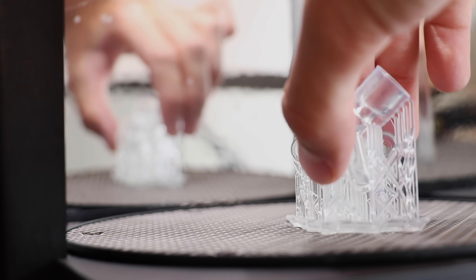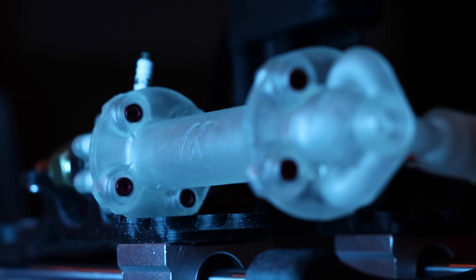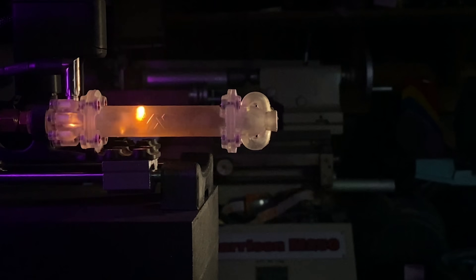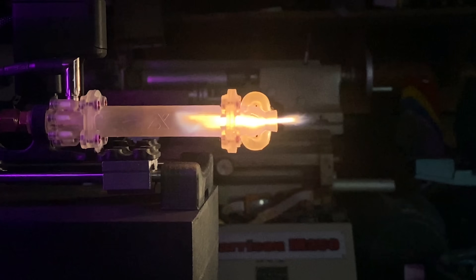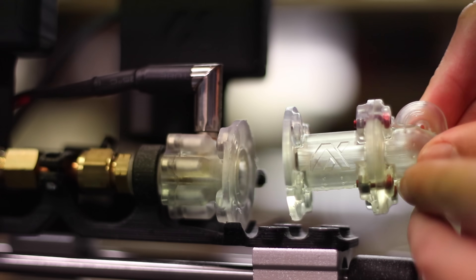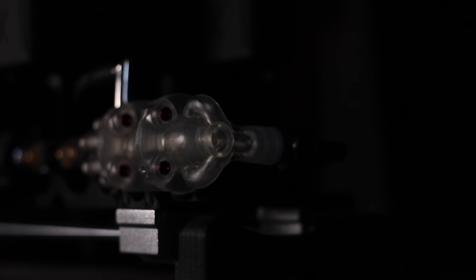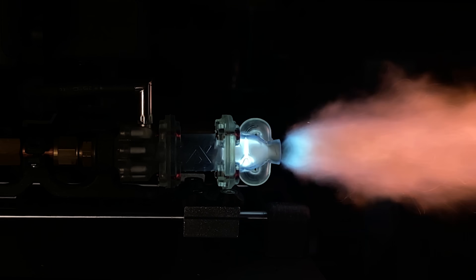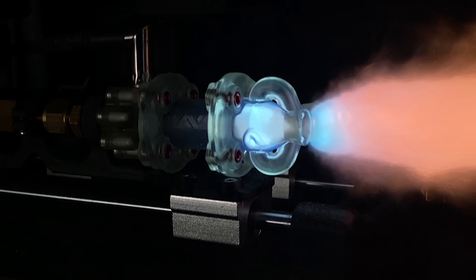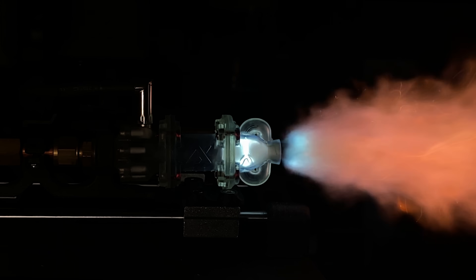The chamber was designed to be modular, so we swapped out the shattered nozzle. These first tests with a long chamber show that the characteristic length of the chamber is too long and thin to sustain a strong swirling vortex. Modularity helped again here, allowing a shorter chamber to be swapped in. This worked much better, easily sustaining vortex combustion. In this test you can see ignition and a slight vortex, then the combustion shifts to outside of the chamber — the flame looks spectacular, but it's not producing any thrust and is no more than a blowtorch at this point.